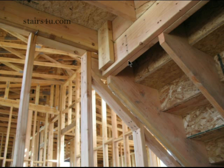Another thing I would have liked to have seen would have been this to be a doubler. You could have gotten rid of the blocks here. These pressure blocks really aren't a big deal, and if they are, you just put them in — but you could have made this a doubler, which realistically it probably needs to be a doubler anyway.